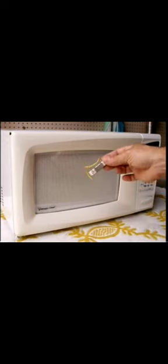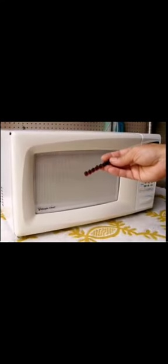You can look for one of these and just pull it out of old equipment and use that. A lot of microwave ovens use a tamper-proof Torx screw on the cabinet to open it, so have a tamper-proof Torx bit just like these — there's a hole in the middle. You can also get by with a tamper-proof hex key. You can find this at your local hardware store, Home Depot, or Lowe's.